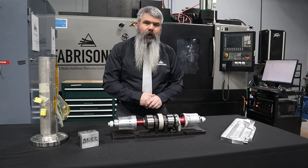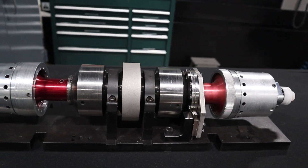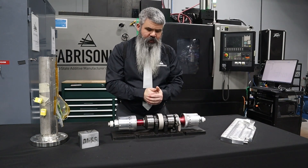The core of our welding technique is this welding head here. It's an ultrasonic welding horn that rolls over thin foils of metal to weld those foils together at room temperature.